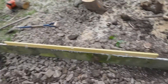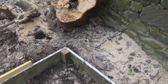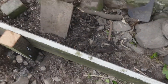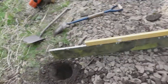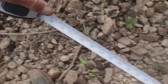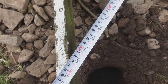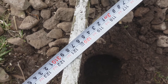Now I'm squaring the next piece, which I've just got propped level, so I'm using the old 3-4-5 method. From that corner I've put a mark at six feet, and from that corner I've put a mark at eight feet, so the measurement should be ten feet across the diagonal. I've put a little saw slit in that timber just to catch the edge of the tape measure.